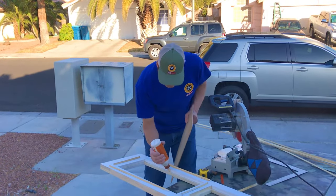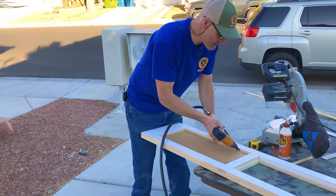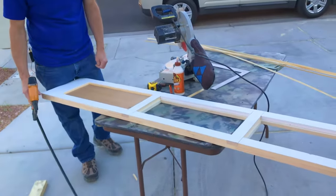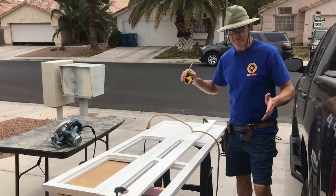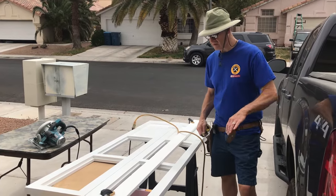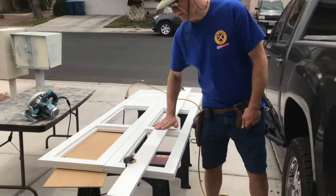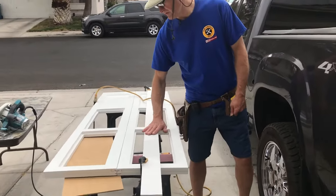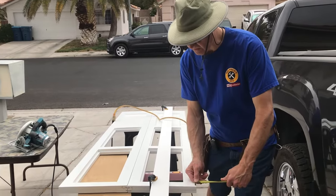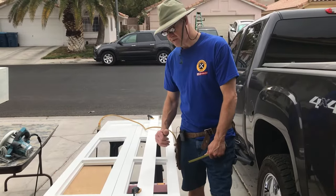This is the last panel on the last door — let's pin this last one in. Last step is going to be to measure for the glass and we'll get the glass ordered. Our overall width for the doors is about a quarter inch too wide, so we're going to cut the left door a little shy of a quarter inch. We've set up a saw guide with a really straight board, measured it out with the saw so that we end up cutting a quarter inch, and clamped it on there to use as a straight edge. That's a good tip for cutting the door.